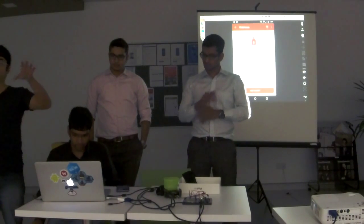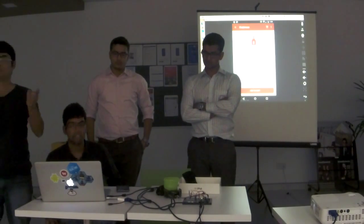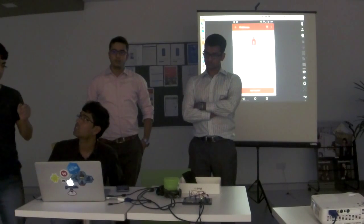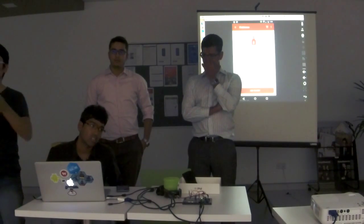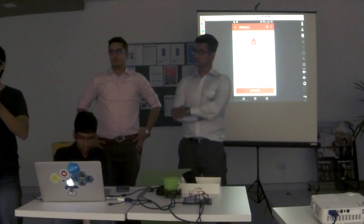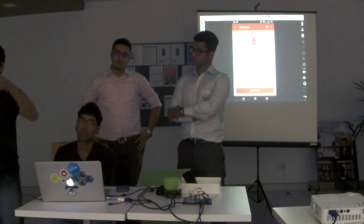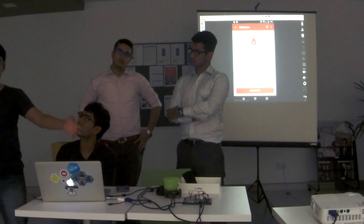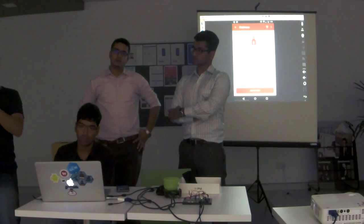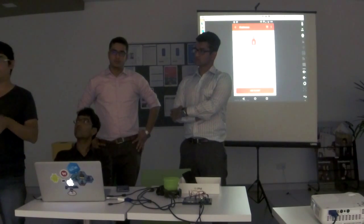When we designed the patient model, we wanted to have some sort of prescription attached to the patient. Using the prescription, you can calculate which brand of medicine that person is using. Our initial idea was to get the jar automatically configured, but since it was a hackathon, we just put in one jar. Ideally, you could purchase these jars and feed in a prescription during the onboarding stage. Then we use this prescription at the back end to calculate the weight of each pill. Once we get a stabilized weight, we calculate the number of pills remaining, and if it drops below a certain threshold, we know that it is getting over. The threshold can be changed, which is something the backend allows.